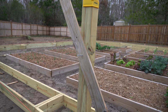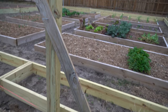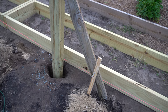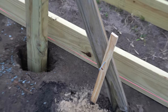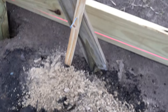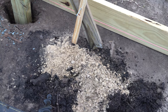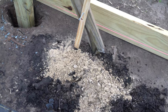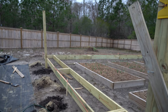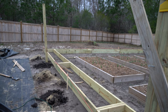After that, all you do is put a screw into a support board, and then I have just a little contractor stake — Lowe's sells 12 packs for like $3 — and that's holding it in place. Then I'm going to backfill 24 inches using the native sand, less the tree roots, and that is going to provide post stability until I'm able to pour the concrete cap. It's getting kind of dark right now, so I'm going to get these three posts in, and once I have five posts, I'll have enough to start breaking open bags of concrete.